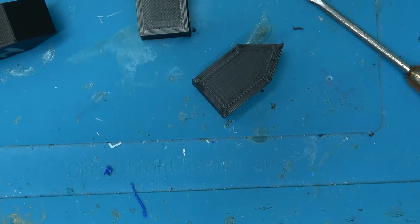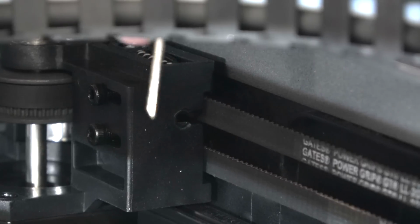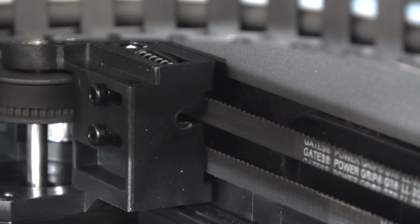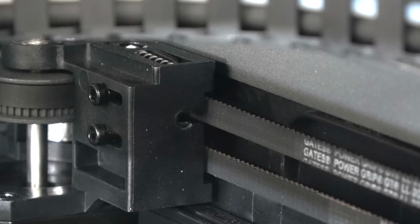So I found a video online, and apparently the reason they include two extra metric screws is because there's another way to tighten the belts. So let's try that. This hole here, you insert a screw into it and it tightens the spring that's visible here, and apparently there's one on the other side as well. That same video, which I'll link below, also says that you can use an app to listen to the frequency of the belts when you flick them with your finger. Okay, 110 hertz it says.